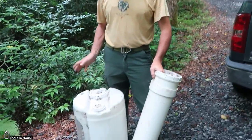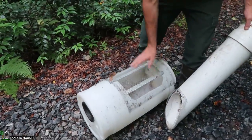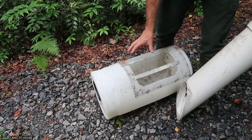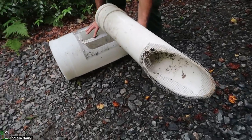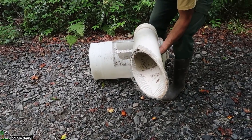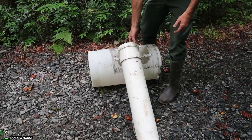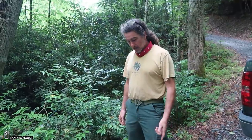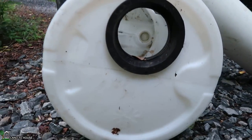This is my third attempt at intake design. The first two were pretty much epic failures. This was the most epic of the failures — there's a rock ledge where I could get some water flowing into this thing and the penstock came out of there. I had it in the creek running into here and it was doing pretty good, but it immediately started to clog so I cut the hole. It filled up and was running fantastically but I was a little over-ambitious on my site selection. It's wide and there's multiple little places where the water runs. I came back the next morning and had to go look for it down the creek because the clay is just not substantial enough to hold back that kind of water pressure. So that was attempt number one.